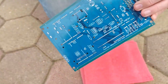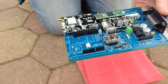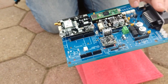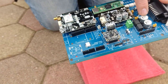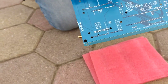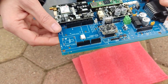Or use the guide on the back side and do it either on the front or the back — it's up to you. I've seen a lot of guys ordering these and missing the SMD capacitor. This is just a 1000µF capacitor. 25V is more than the 14-15V it will ever see, so it's overkill. If you are missing this, you can put two here — it will be a bit taller, a bit different — but feel free to replace that.